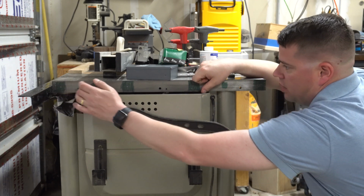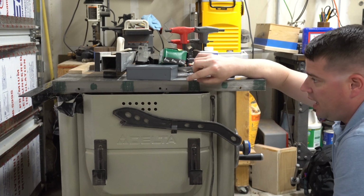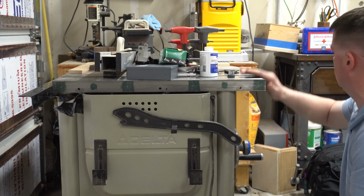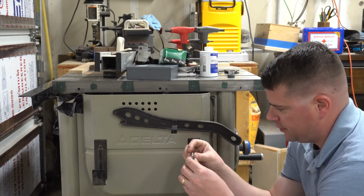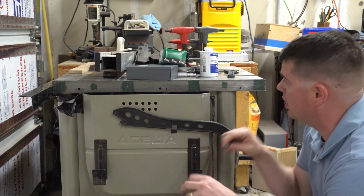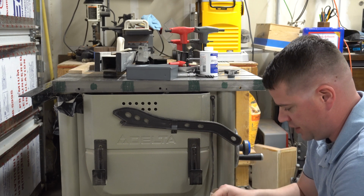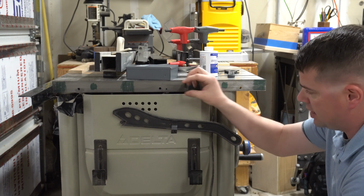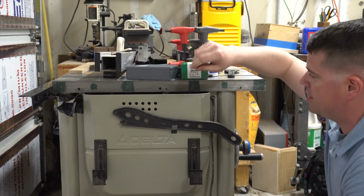And I got 6 spots. And I'm going to be threading into here. So the tap I'll be using is a triple flute 3/8 by 24. And I went to McMaster-Carr and got me the bolts I want to use, and I think it'll be the perfect size. These guys, I got more than I needed because I can't just order 6.